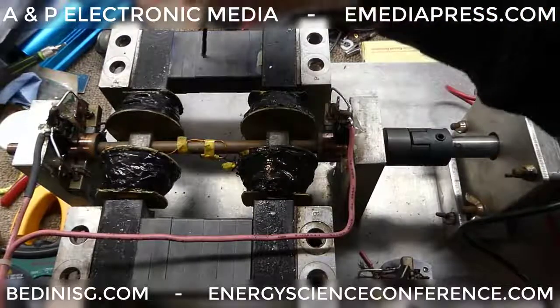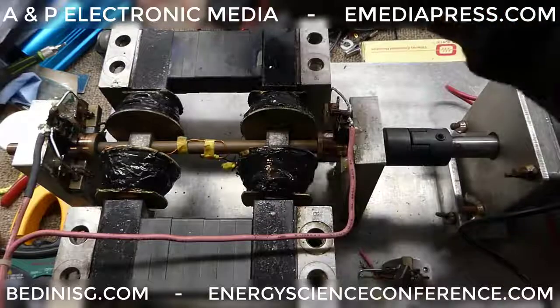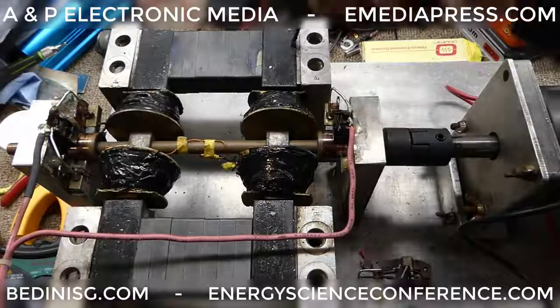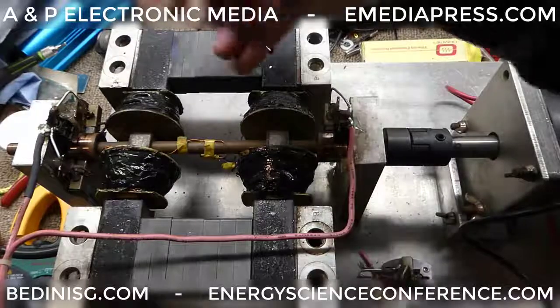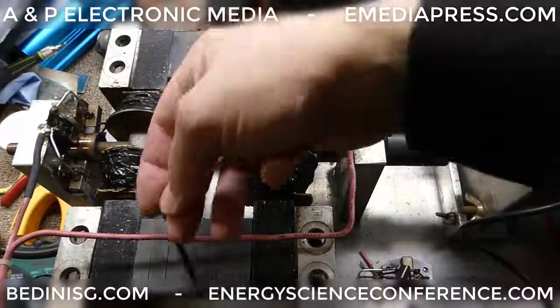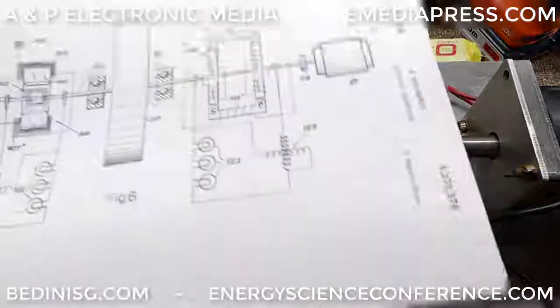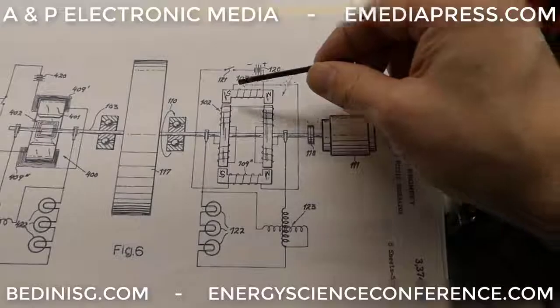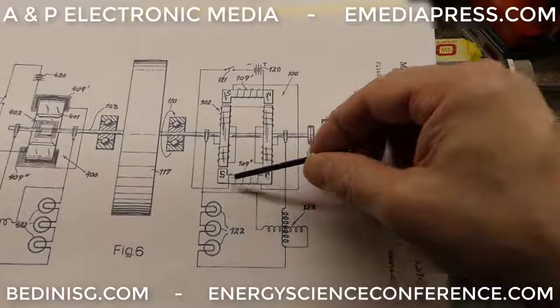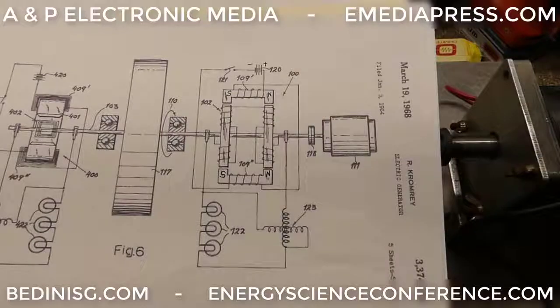So the error is that this winding should — if you're using an electromagnetic style, which I haven't really seen anybody do except in Kromrey's original work — this winding should actually be wound in the opposite direction. These magnets are pretty much dead. You can see this magnetic Allen wrench — when you stack them, you can get a little bit of a field, but on each magnet itself they're pretty much dead. So that winding should be in the opposite direction if you want south here and north here.